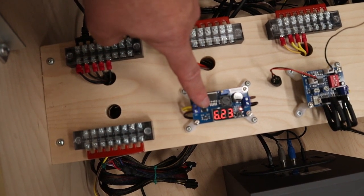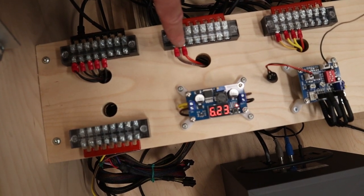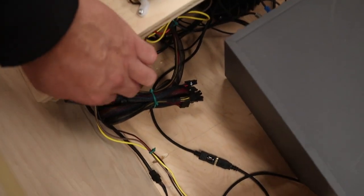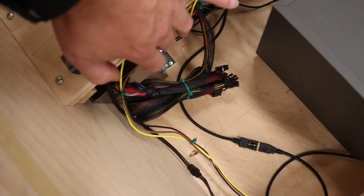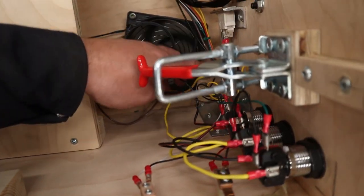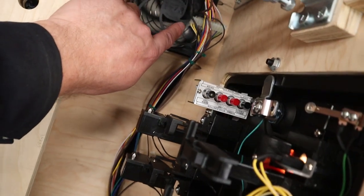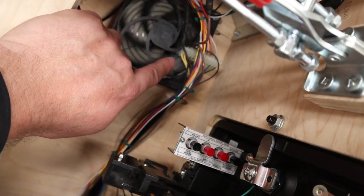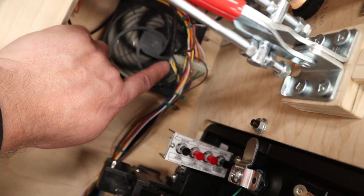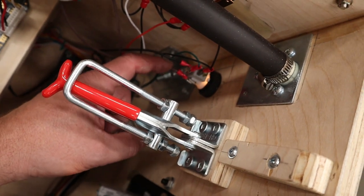So we have 6.3 volts, which is this terminal block. And then that red wire is actually the inline fuse with 1 amp. And then that turns into this brown wire here, runs down the cabinet to the corner. And then it runs along here and it goes to the other of the two yellow connections on the coin door harness that you didn't use for the coin door lamps. And then it branches up from there and goes on to the side of our lamp.